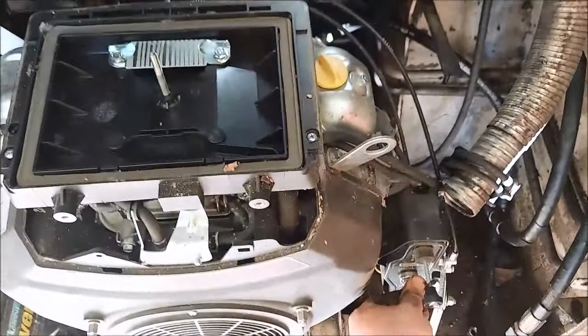All right, back to the Predator swap into this Bobcat. And so what I determined was the gear spline shaft wasn't all the way on there. So I got that on there right. I got it plumb too. And I went ahead and picked up this spacer. That's going to keep it from coming out and then falling off. See how that goes on the shaft? Is this 1 inch? Let me see. 1 1/4.